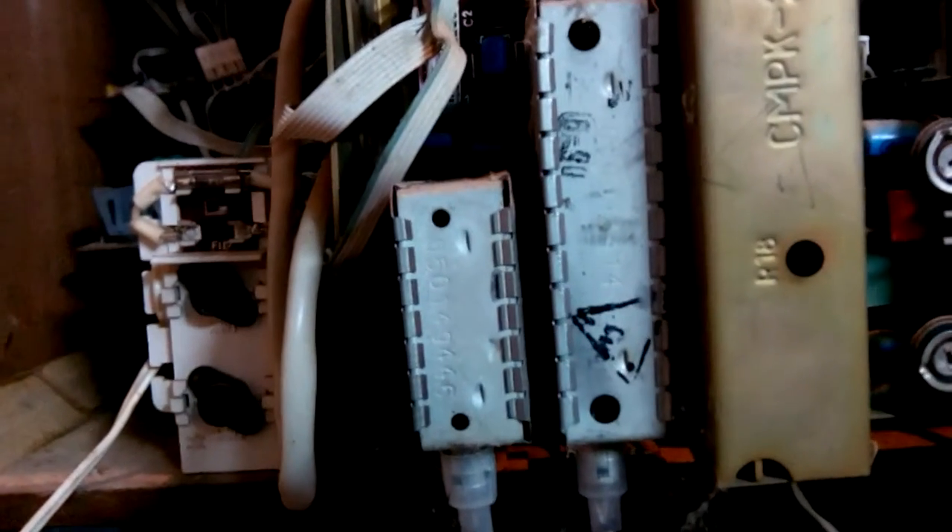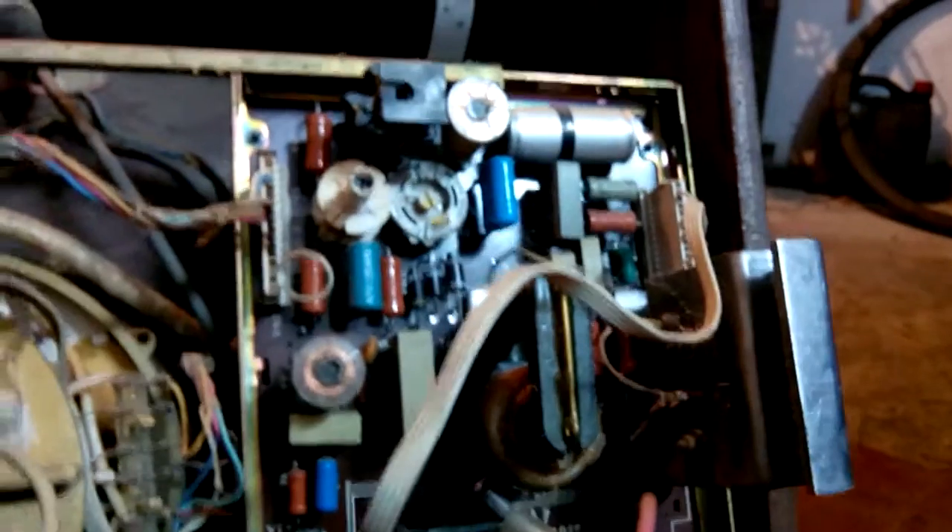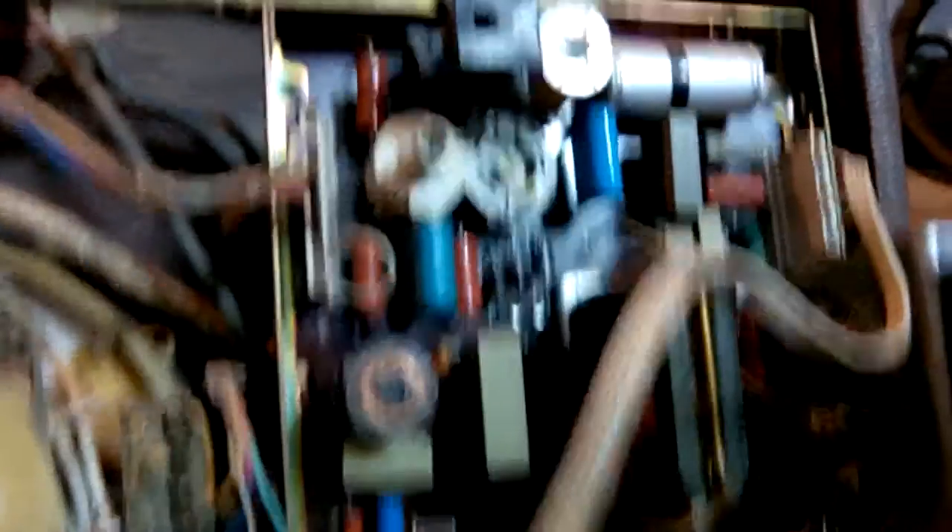This board module houses a lot of RF stuff: two tuners on the left — UHF tuner, then VHF tuner — and the channel selector. This board is the power supply. This board is the interconnections board. This board is the vertical deflection board. And this board is the horizontal output board, which houses the output transistor, the flyback, a lot of other components, and a voltage tripler — well, multiplier, but it's a tripler.